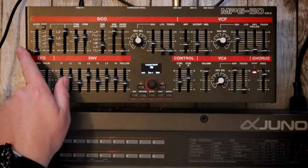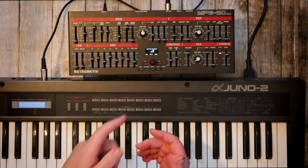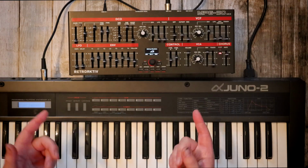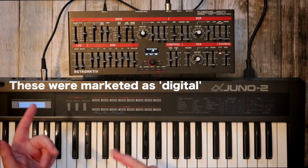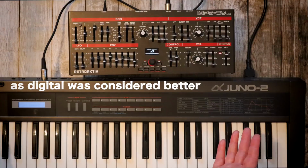I was going to say in a simple looking DCO, but when you actually look at that and compare it to something like the Juno 106, it does look like it's a bit more complex, doesn't it? But being able to modulate the pitch with the envelope and having the sort of super saw on this is really fantastic. But you've got to remember that just like the Juno 6, the 60 and the 106, these are DCOs, which are digitally controlled analog oscillators. They're much more stable than their fully analog counterparts, the much less stable VCOs or voltage controlled oscillators. But without going into too much of the rabbit hole of VCO versus DCO, VCOs are often considered to sound warmer than DCOs because of their inherent instabilities, but DCOs are much more reliable, especially on stage when temperatures can vary massively, causing VCOs to constantly need retuning.